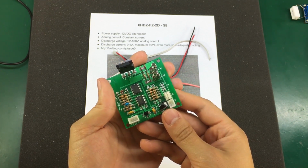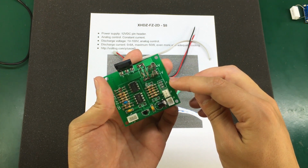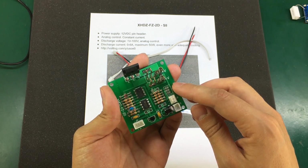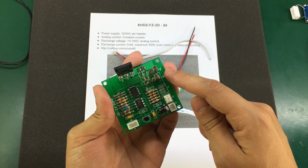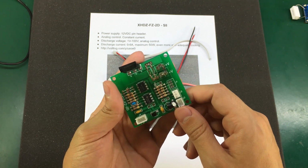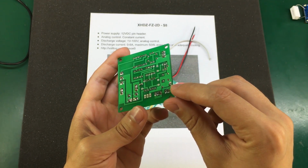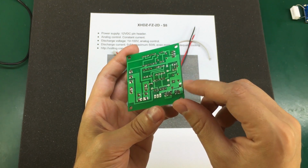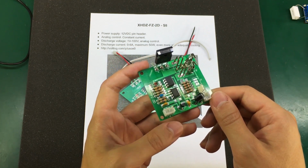We also get some connectors on this dummy load. J1 right here, if I'm not mistaken, is a front panel voltmeter connector. You basically get the V plus input, V minus input, and plus 12 volts on this header. And you also get some pads on the back, I think right here, for connecting the V minus of the load to the analog ground of the board. And we've seen that being done on other dummy loads as well.